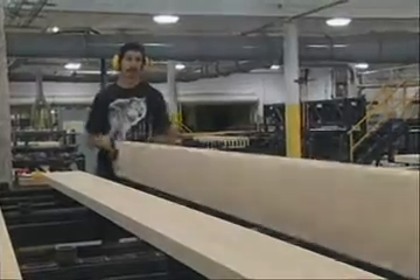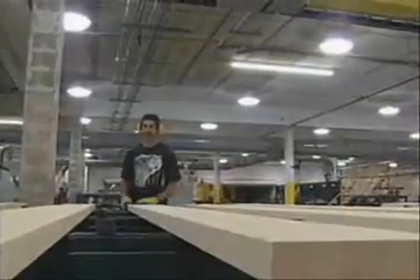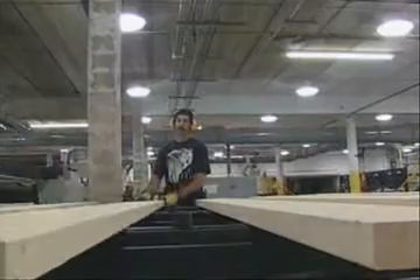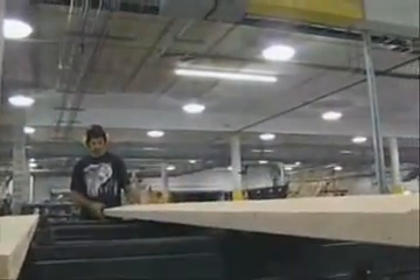The planks are evaluated according to the average strength and the lowest reading obtained. In order to meet the scaffolding grade, both the average and the low-point values must be above the established limits. Planks that have passed the mechanical test are then visually inspected for any defect that may affect plank performance.